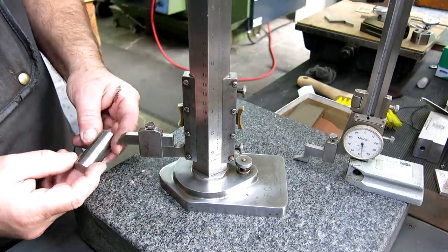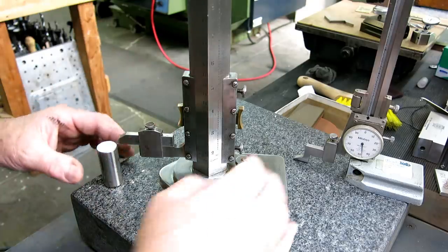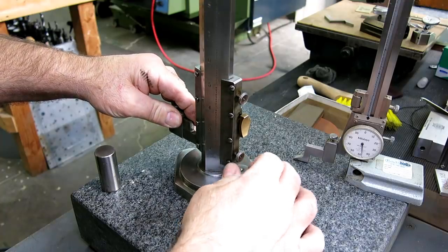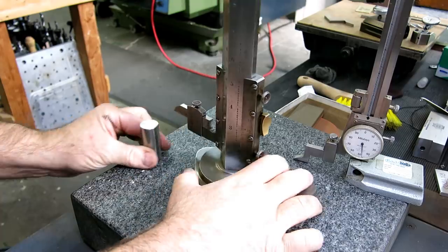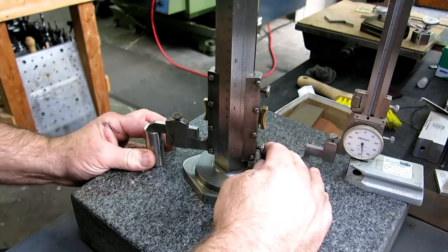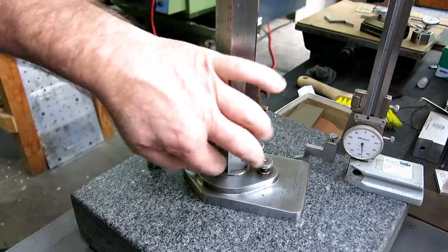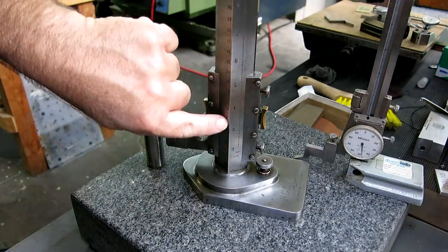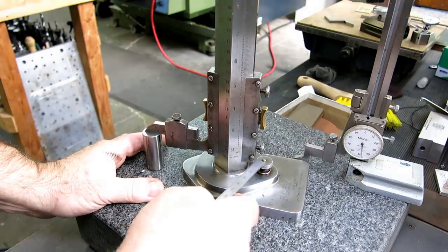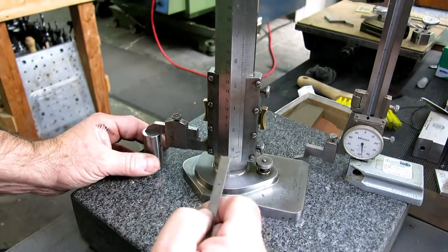And then as part of the kit, it has a little two inch block here. My magnifier's on, sorry guys. I'm blind as a bat without those. That you can just kind of verify that you're where you think you are. And it's off a little bit right now, okay, by the vernier. And so I think, and I haven't dug into it yet, but I think what you do is you loosen these screws and you shift the scale just ever so slightly to bring it into calibration.